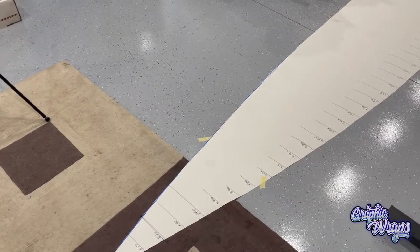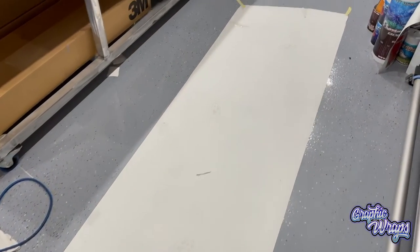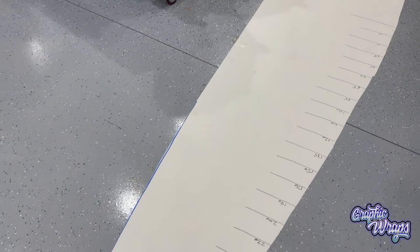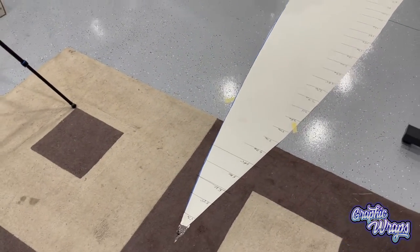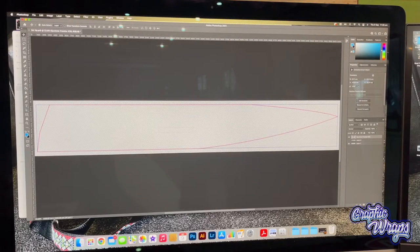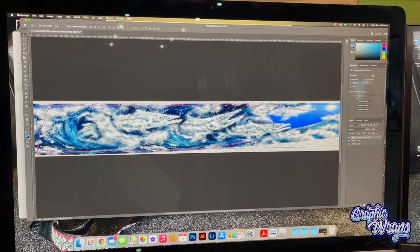So that's the template on the floor with some markings on it so I can project that angle. That's what the template off this boat looks like, and those marks are every 100 mil so I can work out the curves. The top one I did slightly differently. Anyway, that's what that boat looks like in a flattened view. Once you've finished drawing your flattened template, you've got to fit your graphics — in this case it's the Barracuda Wave. I set that up and distort the image or move things around in a layered Photoshop file to suit the shape of the boat. This avoids that horrible swing, so this shape will fit the boat perfectly without any heat or distortion.